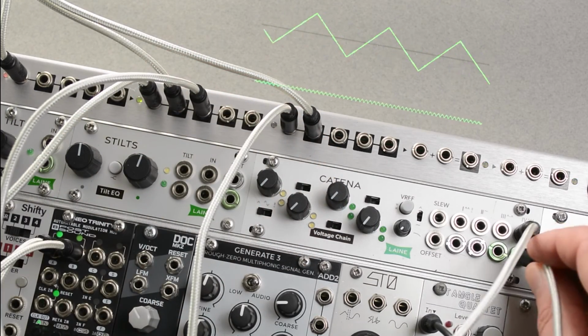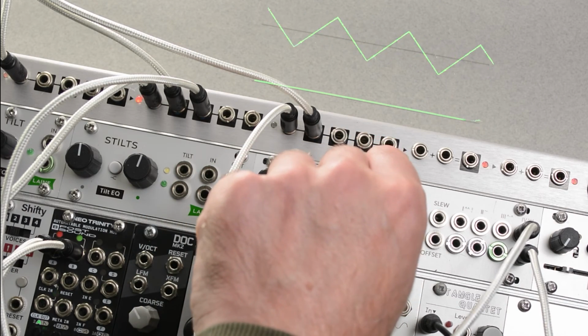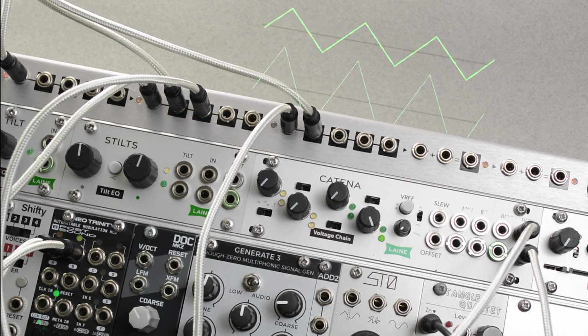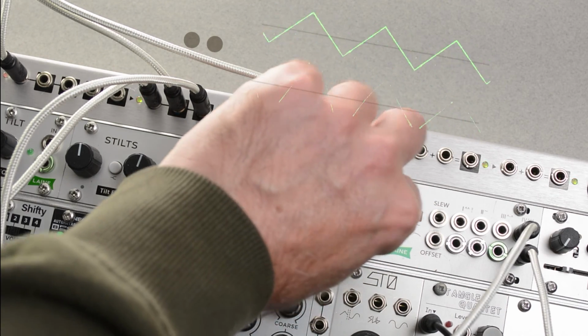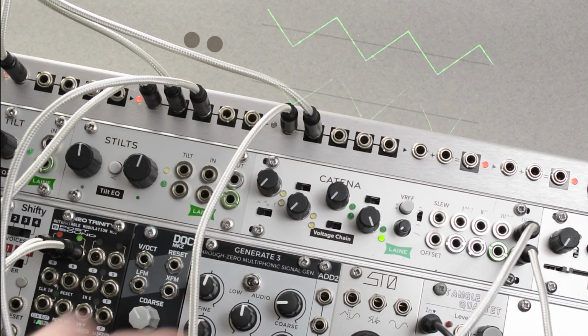The last function to mention is the gain structure of channel 4, which is present in all modes. Instead of the plus or minus unity gain of channels 1 to 3, channel 4 doubles the input voltage at its maximum setting. This extra gain only applies to the patched input, leaving any chained signals or voltage references at their original value.